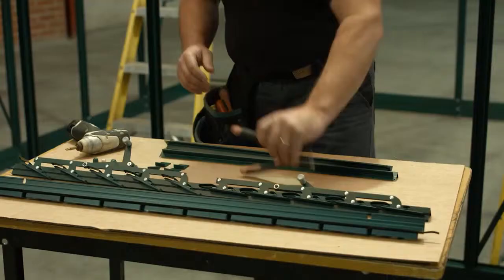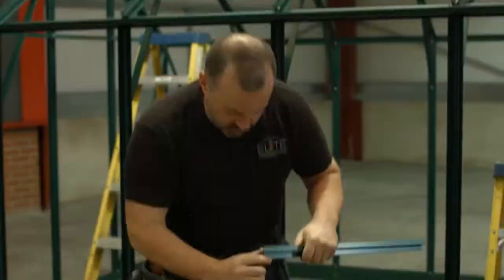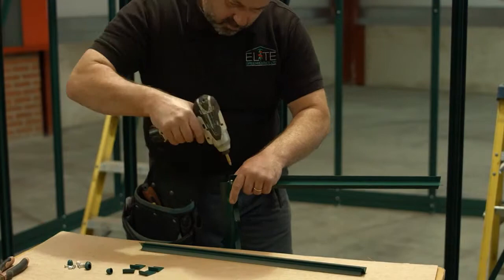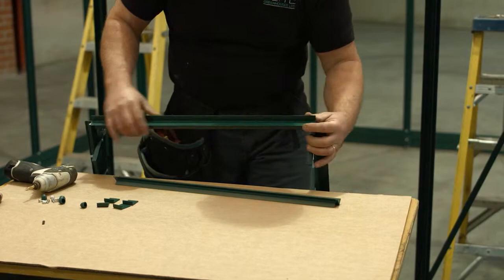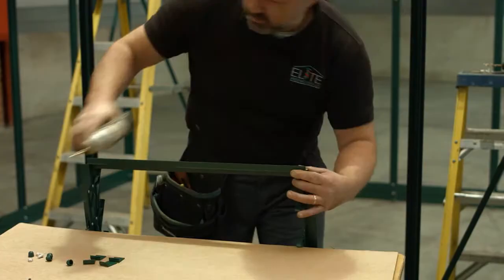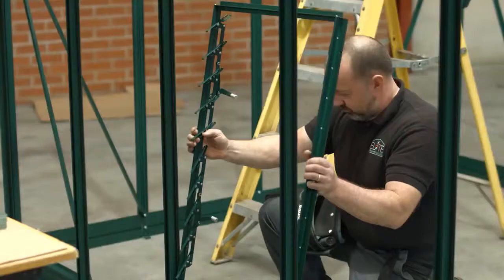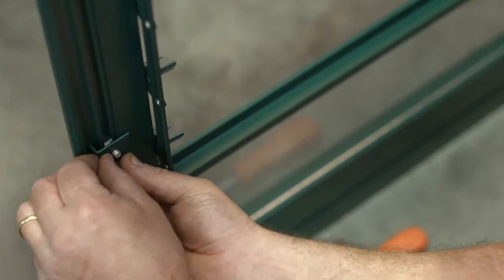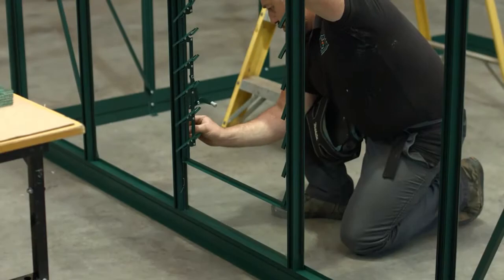Ten blade louver. Lay out the parts and keep the handles on the right-hand side viewed from inside. Secure the top sill and bottom to the side jams using self-tapping screws. Make sure the sill is fitted to enable the louver clips to open and close freely. Fit any glass required under the louver, then slide the louver into position. Insert half-headed bolts to the glazing bars and before adding the nut, loosely fit the small fixing bracket, then tighten.